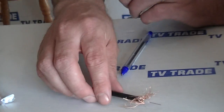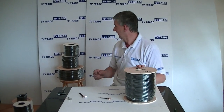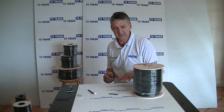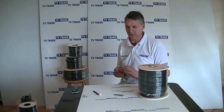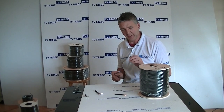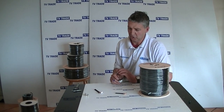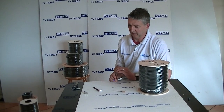In terms of what length is this cable available in — we have it in 200 meters and also a 100 meter roll. In this scenario we would simply be running a picture back from a camera that has its own power source. Where we needed to actually run power to the camera, we might need to use a different type of cable, such as this RG-59 and 2-core power cable.